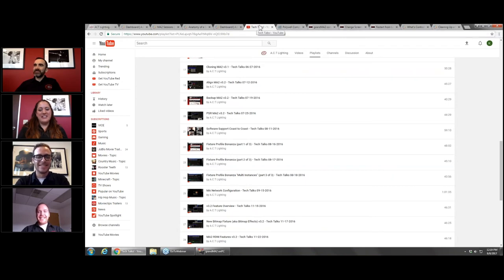DMX cards can go bad, even in Clay Paky fixtures, components can break. Yeah. And also firmware updates. Fixtures can have firmware updates, and then the profile is for the wrong firmware version that doesn't match your profile or that doesn't match your fixture. Yeah. And if you have that issue, give us a call, shoot us an email, we'll be happy to help you.